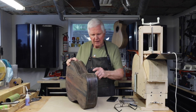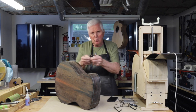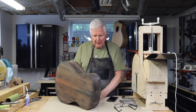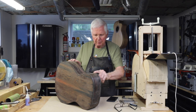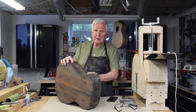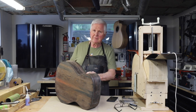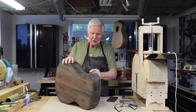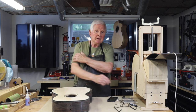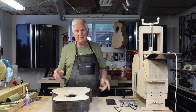All right, we are back. Literally a chunk of binding and the purfling fell out — just broke off. It crumbled, went to nothing and came right out. It wasn't like the glue broke and it became loose or anything. I think it was too brittle, and I believe this is a humidity problem because it's very dry down here and this has been here for a while acclimatizing. So I think what happened is it got so dry and so brittle that it just had no moisture to hold it together and crumbled in my hand. That is not good.